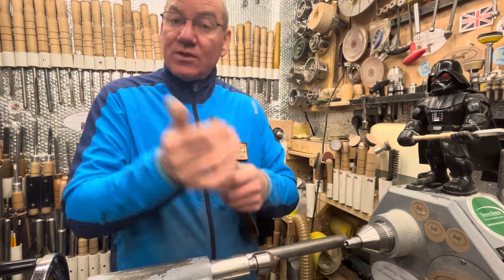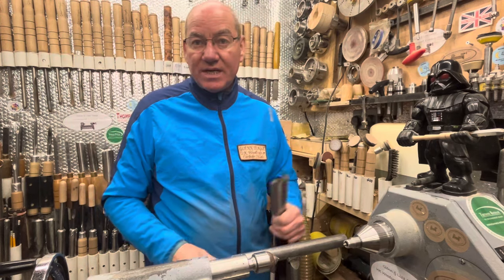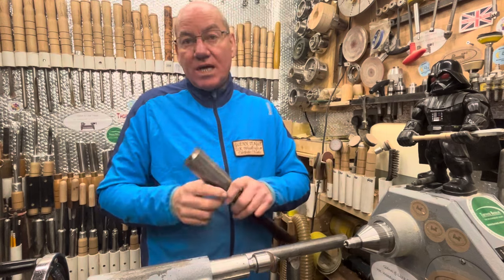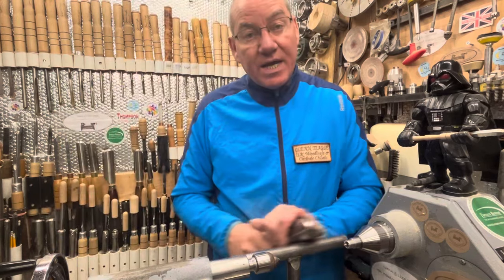It's catch free. That's why I always show a new turner, Lisa, for a first time, a piece of wood on, right, do that, boom, no problem. Never get a catch. And I prefer to do it with the roughing gouge. And that's how it works, yeah. Jennifer was the same. She came along and she was brilliant. And I said, right, now you change and do it with the other hand. And you come in and do it with that hand.